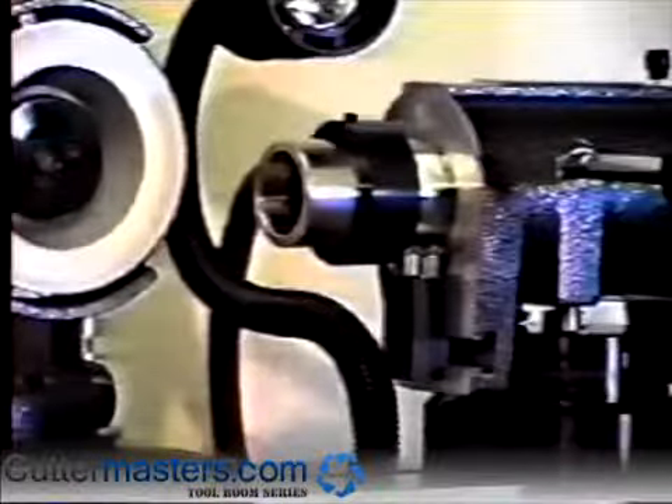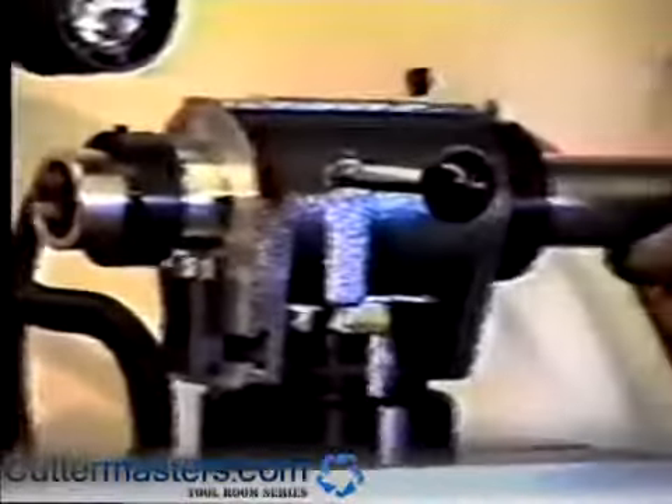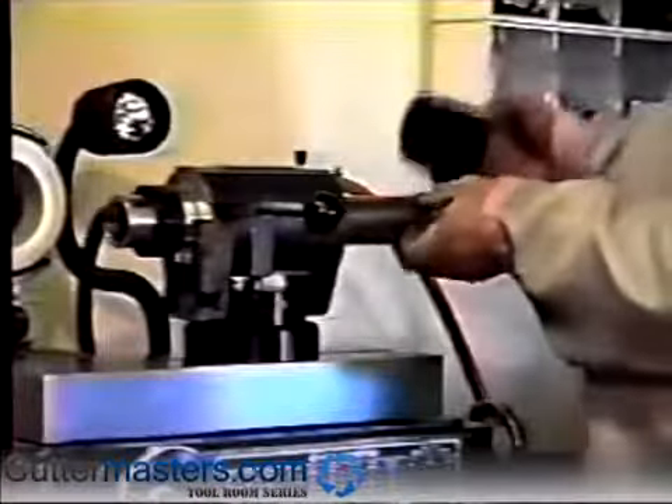The side of the cam that has the relief will be on the follower. Remove the air bearing's indexing ring and draw bar. Slide the spring housing over the quill and compress the spring housing approximately three-eighths to one-half inch so that the cam is pulled into the follower.